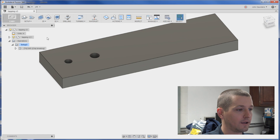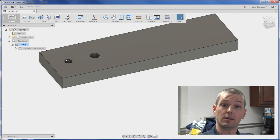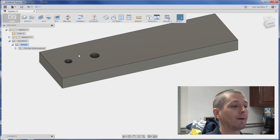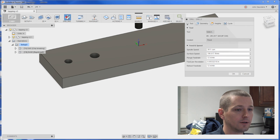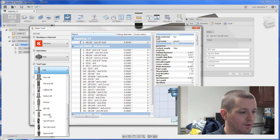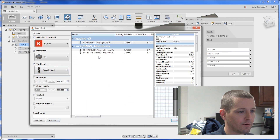I've already got my 0.201 drill drilled out because 0.201 is a number seven drill — that's your pre-drill for tapping. To tap it we'll go to drilling, and I'm going to pick my tap. Change the filter to tap — should be number 51.